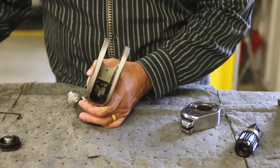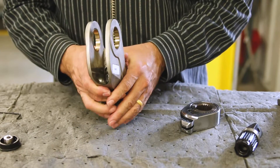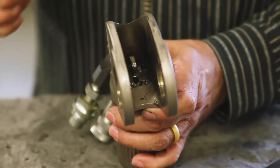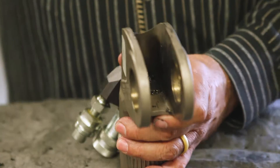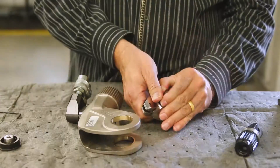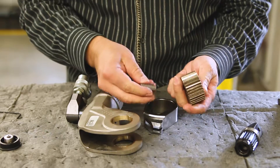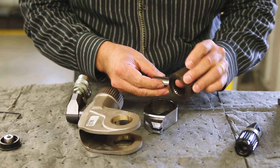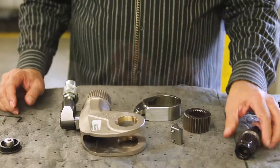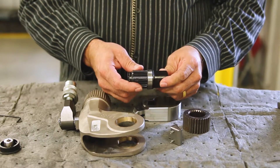Use a mild solvent to clean the components. Inspect the piston rod hook as well as the bearing surface of the piston rod for damage or heavy wear. Inspect the inner housing for heavy wear. Look for worn teeth on the ratchet and drive shoe. Inspect the ratchet lever and pin for cracks or heavy wear. Inspect the square drive paying attention to the splines and for excessive deformation on the square drive.